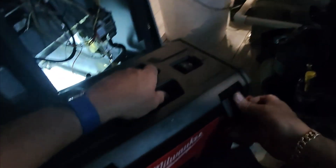These just slide out so we will take them out. One thing I love about the Weil-McLain is that I do not need to lay on the floor to put them back in — they go back in peacefully. You'll notice they're all fairly clean. There's a little bit of white debris, which is unusual — I don't normally see that. That's probably going to be the ceramic coating that's inside there, but it looks fine.